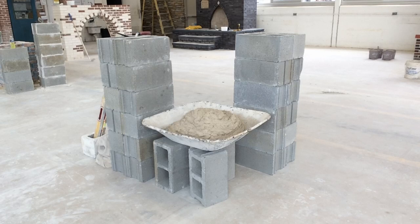The reason why it's stocked this way and not in a straight line is because once we lay out the very first course, for the rest of the construction, we're going to make pretend that we're working on scaffolding, meaning we're not going to have the ability to walk around the corner to the outside. This adds a degree of difficulty to the construction process.